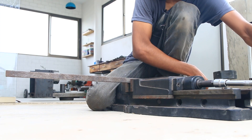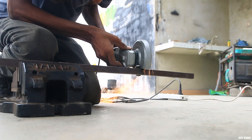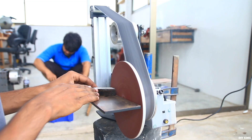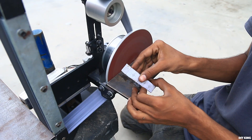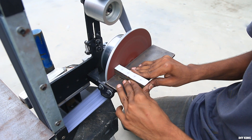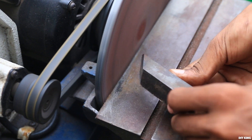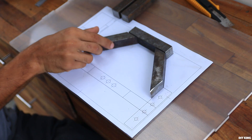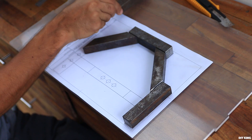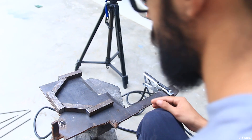The bed holder is made out of 20 mm square metal bar, as it's going to offer rigid support on either end. It's made out of four pieces that are going to be welded together. We sanded these parts on our DIY belt and disc sanding machine that we designed and built in a previous project video — the link is in the top right corner. We then tapered the edges to get the welds deep enough to ensure rigidity. Once we finished all the pieces, we placed them over the two-dimensional layout to make sure everything falls right in place, then held them together using super glue before welding all the joints.